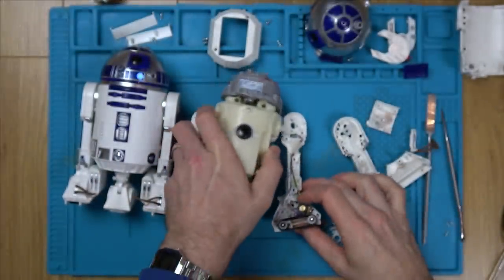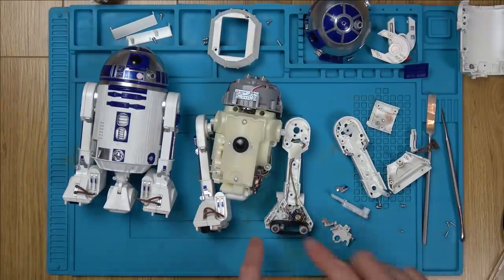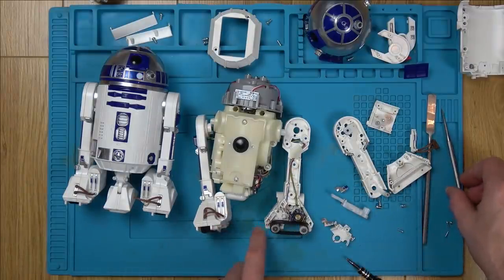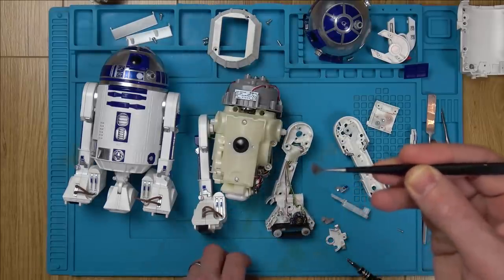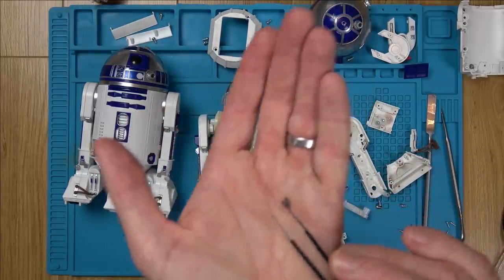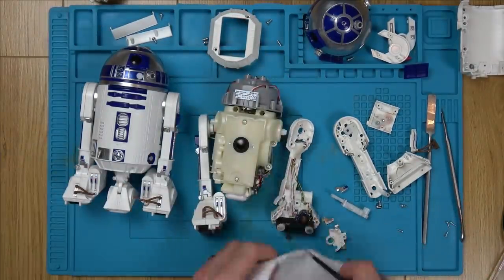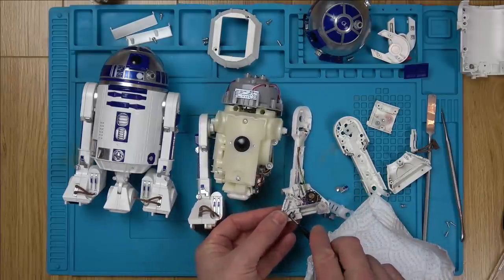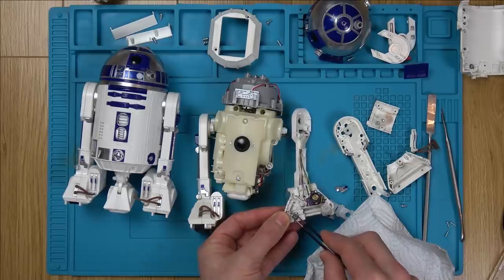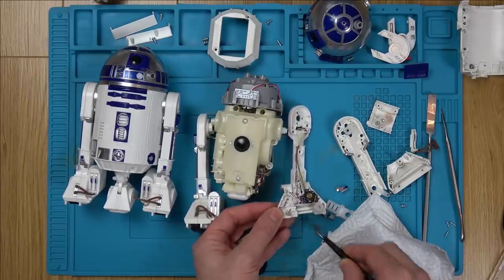The wires run down from here to the motor, and there also appears to be a hall effect sensor - there's a magnet and sensors underneath it so it knows the position the leg is in. I'm going to clean out this leg a bit and put it back together. Look at that - there's a nice lump of hair here, and more hair throughout, which is probably what's making this one harder to turn - the extra resistance of trapped hair.